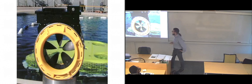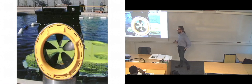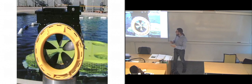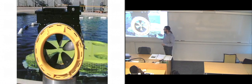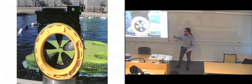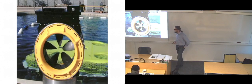And this means that you can basically compact the thruster quite a lot. You can get it quite a lot smaller and still have the same flow through it. And also considering the volume difference with a hydraulic motor compared to having just this electrical ring here, there are very few components on this one to move, so the volume of it is a lot better also. So you take up a lot less volume, which means that you can compact your entire ROV quite a lot more.